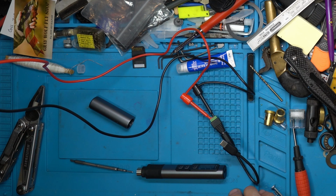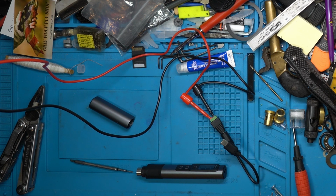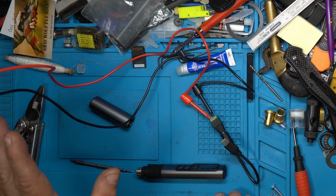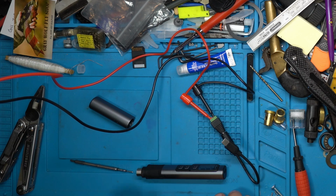on that channel. So I was kind of wondering, because I accidentally started it up during my testing before I started this video, and I only had it on one channel, and it started, and I was kind of surprised to see that. So I can definitely tell you right now that as long as you can supply 20 volts at an actual 3 amps, it'll start. Now I would recommend 5 amps. And that's why I put my power supply in parallel, because I figured I would need up to 5 amps to start this iron, but you don't. You need just under 3 amps to start this iron.